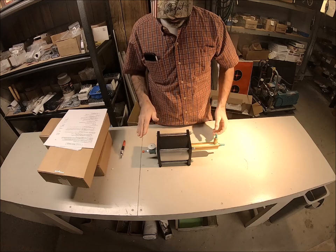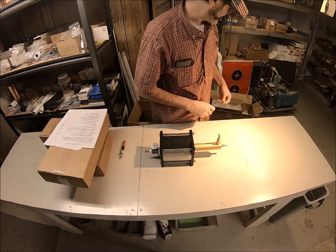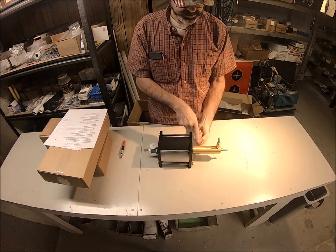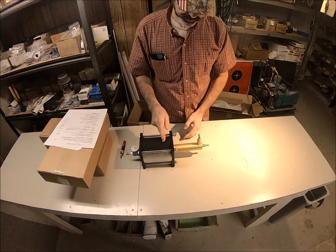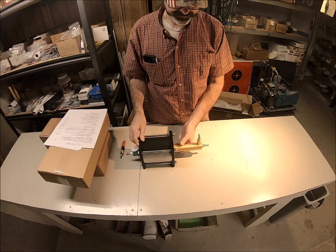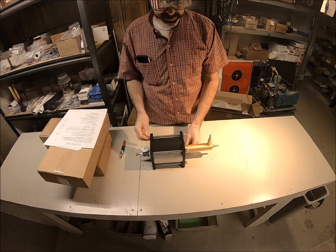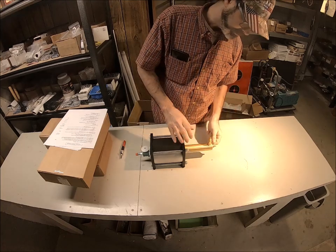This is what looks like a standard pump. Boosters — whether it's Haskell, Teledyne, or any of the big companies — you get a big piston washer in here and a shaft. This fills with air, and as you activate the pump, the piston gets pushed forward. The air trapped in this shaft gets squeezed into the air rifle. It has a one-way valve so the air can't go backwards, and that's how you're able to drain a 3,000 PSI tank and force that air up to 4,500 PSI fill.